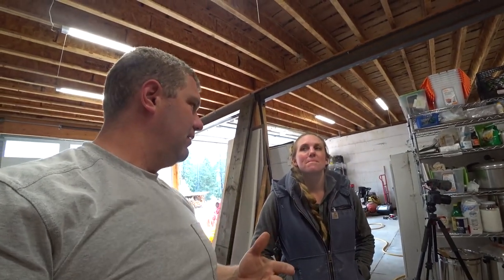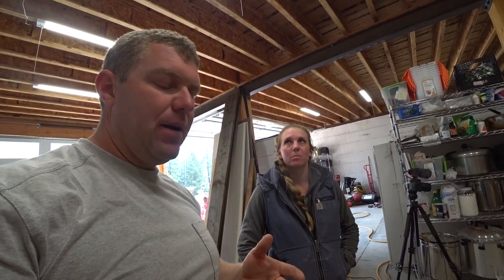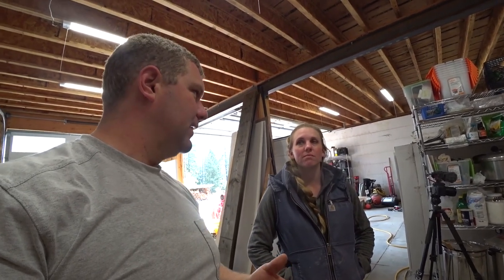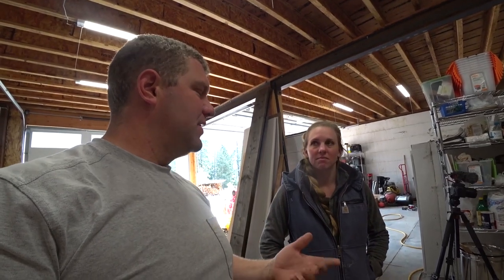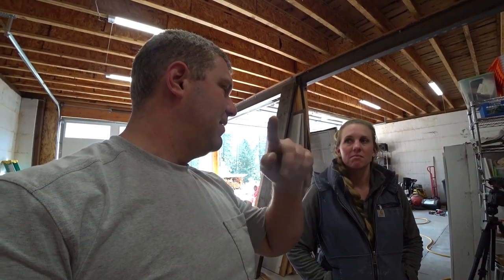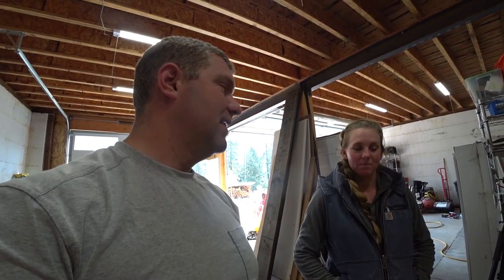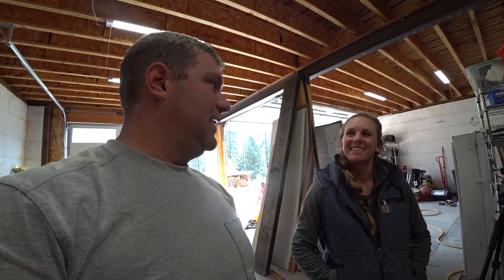So what I'll have you do is go out and just fill it with water. Okay, from up there. Yep, hose is already up there. And then I'll be in here just looking for leaks. If there's any leaks, I'll just have you stop. We may have to just bleed the system down, but basically, the goal is to get it to where the water is right at the tippy top of that elbow that's sticking up out there. And it'll take quite a bit of water. It'll probably take 10 or 15 gallons.